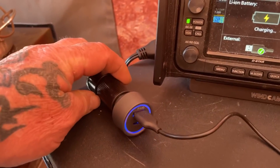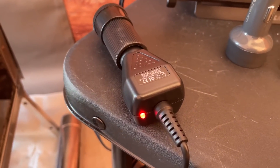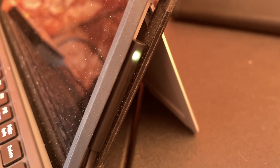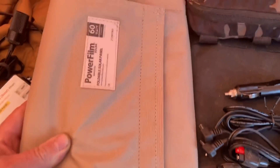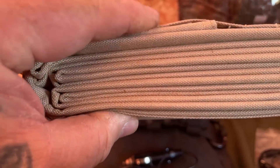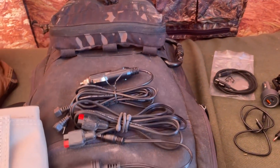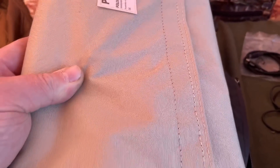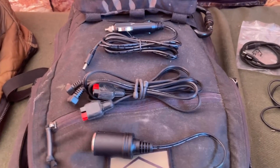We're charging that battery off the solar panel while using the battery as power for the radio. We can also plug a 12-volt laptop charger into that same solar panel socket and charge a laptop. The folded 60-watt Powerfilm panel takes up about as much room as a laptop — maybe three-quarters of a thumb thick — and compresses quite a bit. That's step one if you're making a dedicated pack: a dedicated radio pack that could carry this panel and cables.